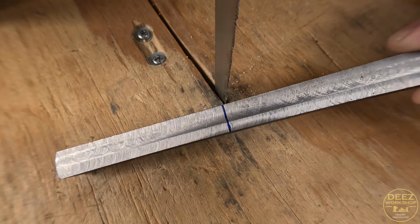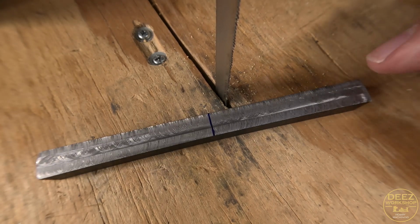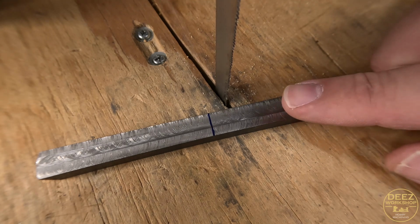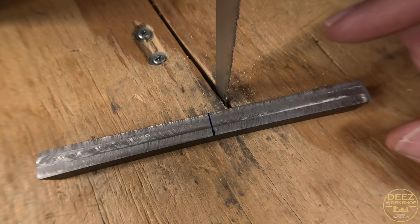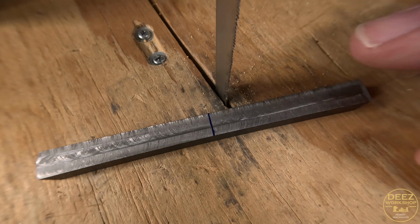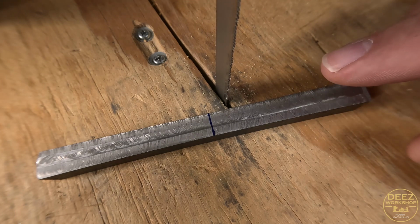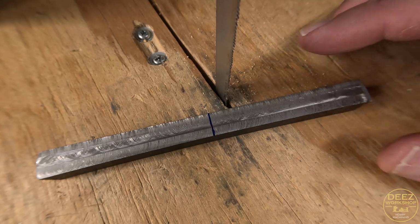We're going to cut this in half to start. I've kind of got a game plan on how I'm going to attack this. I'm going to stack these in the mill vise, and we're going to drill the smaller diameter hole that will be threaded, tapped on all 4 holes to start with. And we'll come back later and we'll remount the holes, drill them larger to be a slip fit through hole for the screws once we get them going.